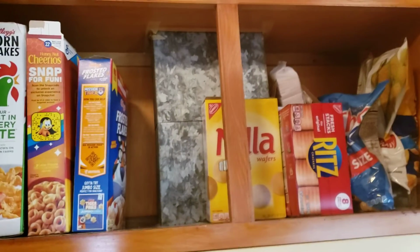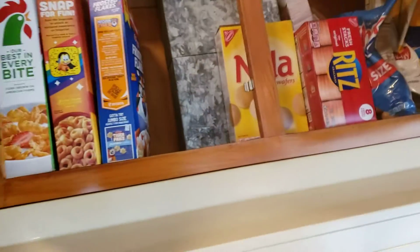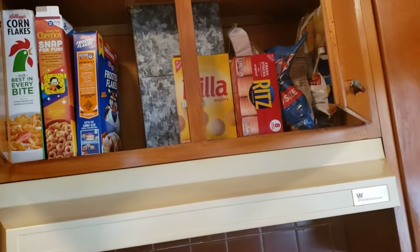Again, back over on this side, if you're looking at the original layout, the cabinets actually have a duct in the ceiling above where the cooktop is. If this is going to become an over-the-range microwave, that duct will probably end up going bye-bye. When I'm looking at the duct, it's loose, so it's probably just cut into the attic. It probably does not go through the house into the roof line.